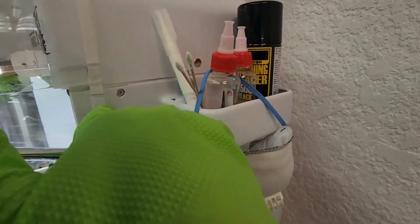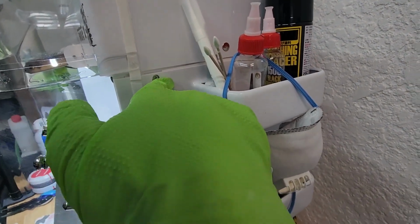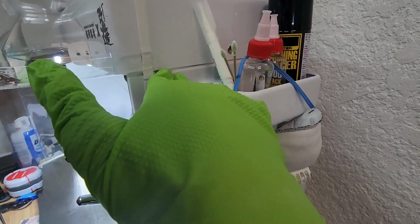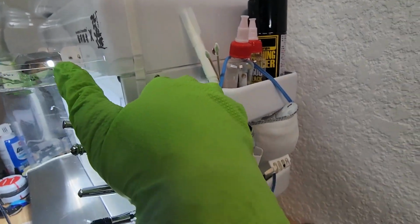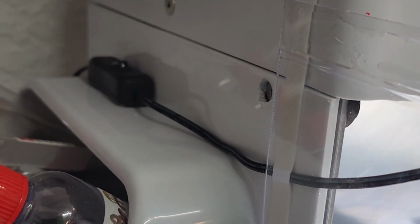One thing I also had to do, I don't know if I went through this in the video, is I had to make these holes a little bit bigger, because when you lay this plate down on the side, you want this to be flush, and then you put the foam tape in there. So if you look in there, I put strips all the way around the corners. So one here, one I believe along that side, one along that side, one along this side. And I tried to get that plate to sit in there as flush as possible.